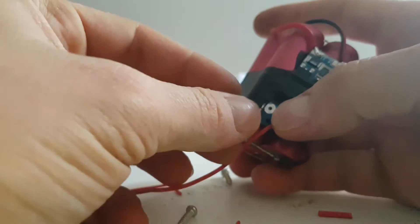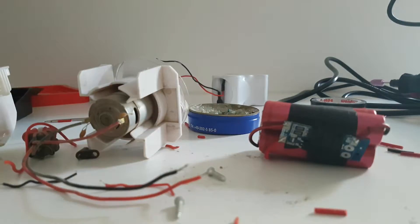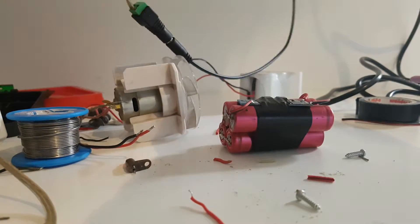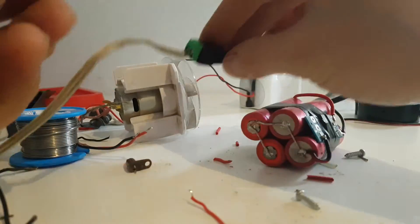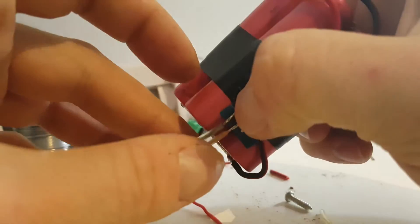I'll use this adapter — let's see if it works. We need something to initialize our BMS port and that's why we need some volts to do that. I'm going to use an 11–12 volt charger. Let's see how it goes. Just like that — use this 12-volt charger, connect it, plug it in, use this adapter, minus, positive, and connect here just like that to start the BMS.